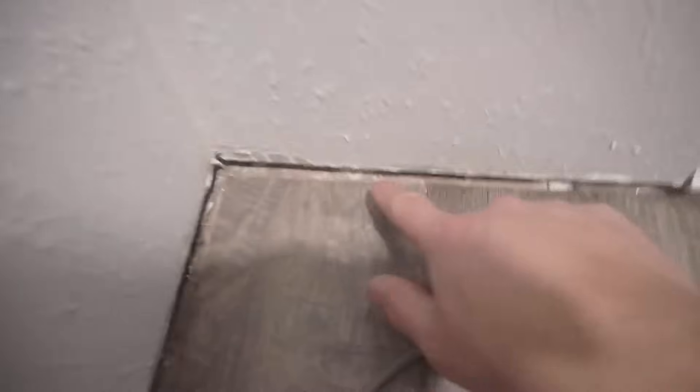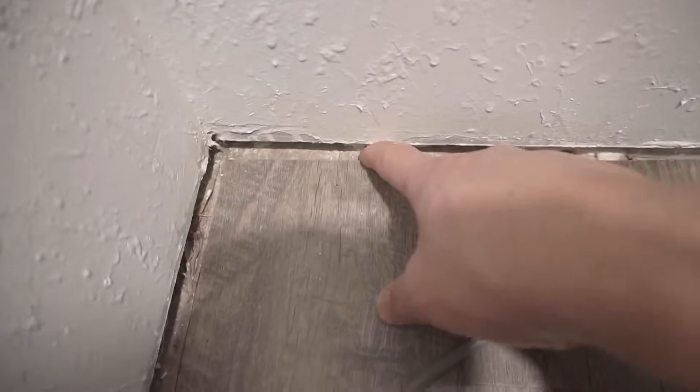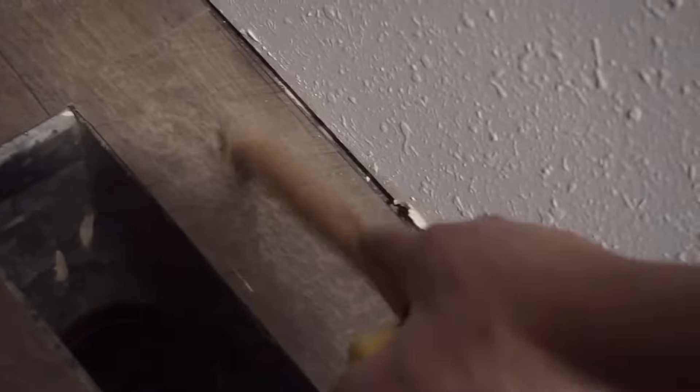I'll leave all the tools I use in the description down below. If you retract down to where this flooring leads to, you can see that I haven't put baseboards yet. Your flooring should have at least a quarter-inch gap on each end. Now you have a choice of how to separate this flooring to get to that damage — we're going to have to separate where that loose part is and shift it all the way to the end.